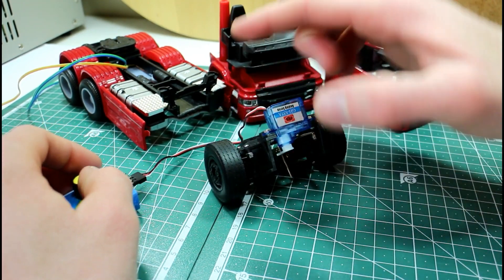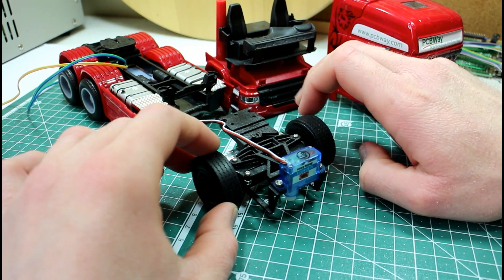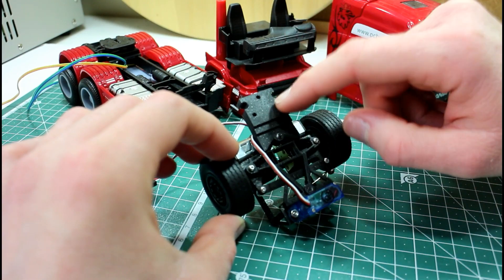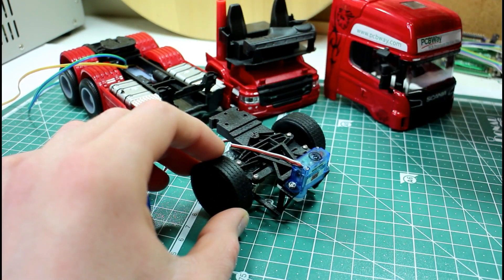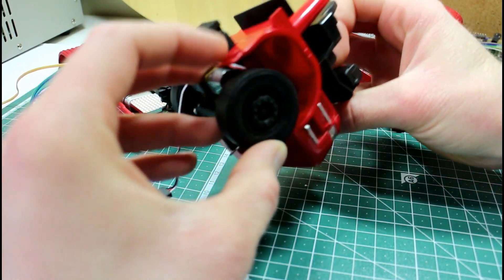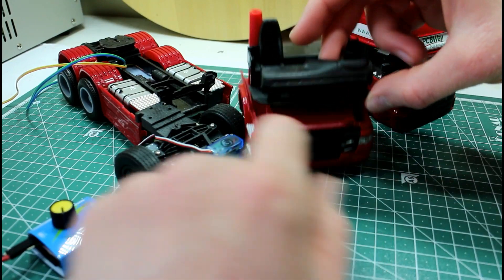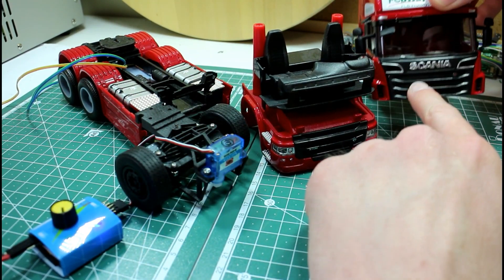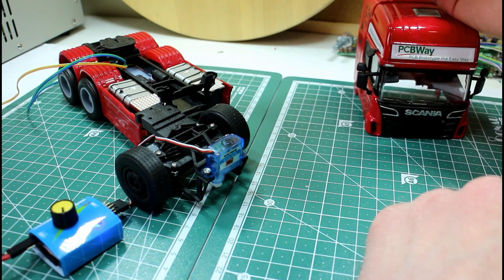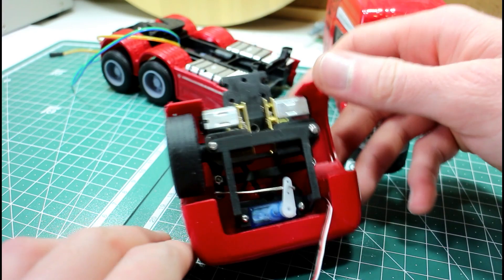The mechanism is working pretty well, so I'll reassemble the rest of the truck. The cab screws on here, that screws onto this piece, but we'll have to screw this piece onto the rear section first because it will cover over the screws at the back. I think we need to cut a rectangular section out here at the front just to let the servo pop up through — you won't see that though because it'll be hidden behind the grill.